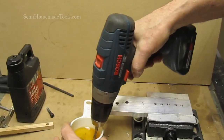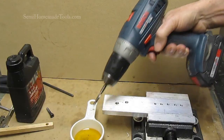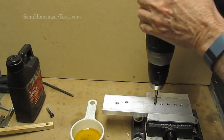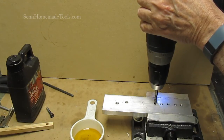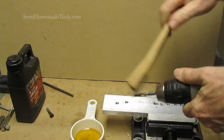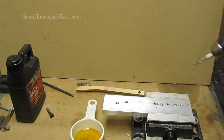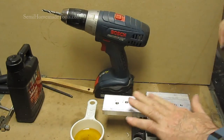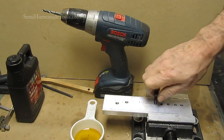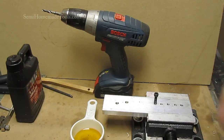I'm going to show you how that works. We're still going to use our thread cutting oil, and we've got a hole that's already drilled. You can see I can already go in up to the point where it's ready to start cutting threads. You don't want to go as fast as you possibly can, but you can go awfully fast. Then we reverse it and come right back out and it's done — gives us a nice clean hole. If you have more than about five or six holes to tap, this is really a big time saver. You can find a link to where to get those right on the website.